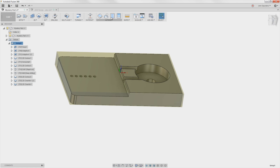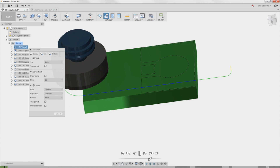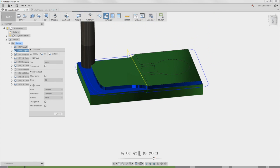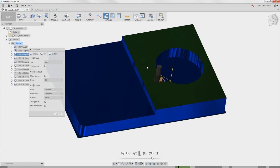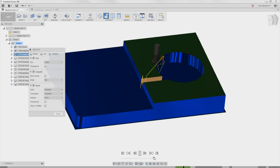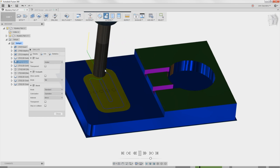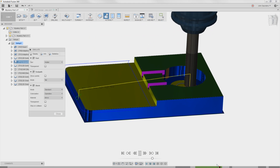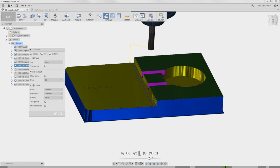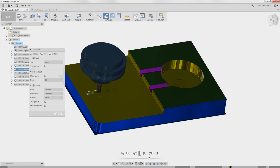Let's look at what's wrong and figure out what I need to fix. Simulating: we'll deck it off with the superfly, then a whole bunch of shear hog, and a little 3/16 to clean up these slots. Contouring them out. We left some stock on the floor after the shear hog because it doesn't leave a perfect floor finish, so a half inch end mill cleans that up. Same thing inside, then a 1/4 inch end mill to clean up the other geometry.